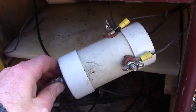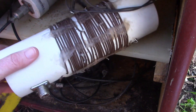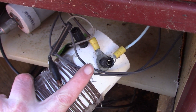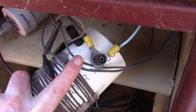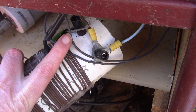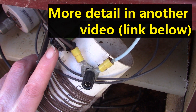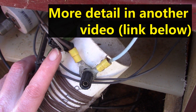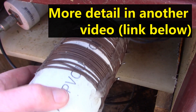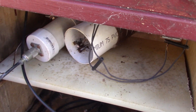This is what I use for 160 meters. Here you've got the connections to the radials — a few bits of wire as long as possible around the yard. Then the other connection — that's where you connect the joined-up bottom of the ladder line going up to the antenna. Then there are turns of wire with a tap here, and then the antenna socket.